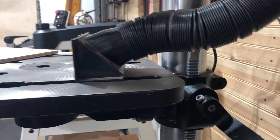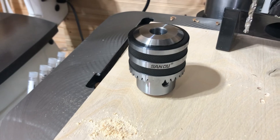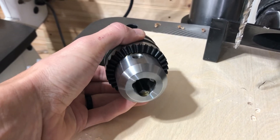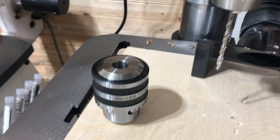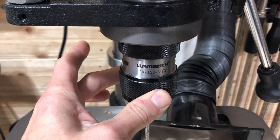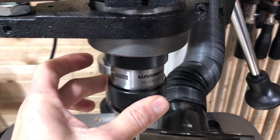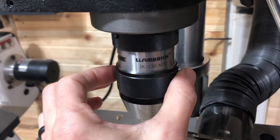The up-and-down mechanism is pretty basic, just like most drill presses, and it works nice and smooth with no binding. One thing I did right away was upgrade to a high-quality precision keyless chuck. The chuck it came with seems nice and is quite large, but unfortunately it doesn't close all the way down, so you're limited on how small of bits you can hold. I went out and found a Albrecht JK130 MT2 — a number two Morse taper — and it is very high precision. I'll throw up a dial indicator so you can see the runout.